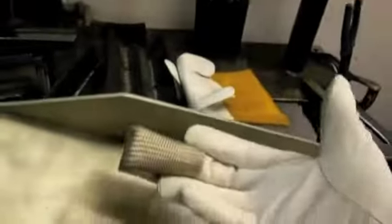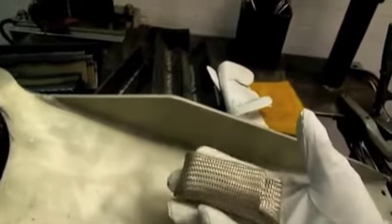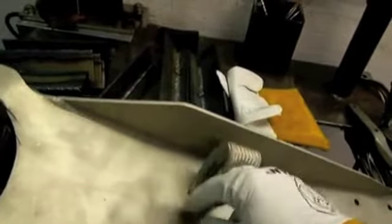For aluminum parts — aluminum parts get hot. They get hot quick and it makes it downright uncomfortable. If you take a TIG finger and slip it on your finger, because it's made of such heat-resistant material and because it's so slick, you're able to hold the torch and prop it right next to the hot metal on the weld and slide that torch along just like you need to.